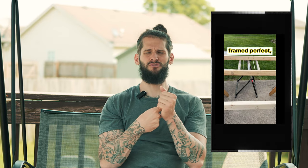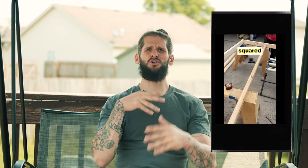So once we got the supplies, we brought them back over to his house and we started to frame the walls. Really the main tools that you need is a circular saw and a drill, a level, a tape measure. Once we got the walls framed, we could put the plywood on the outside, put the insulation on the inside, put the plywood on the inside, and then the walls were finished. So that was the first thing we did, was frame the three walls.